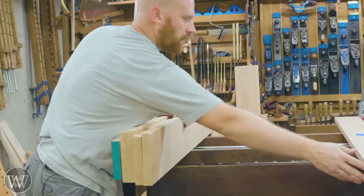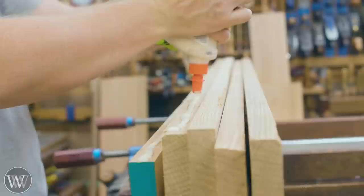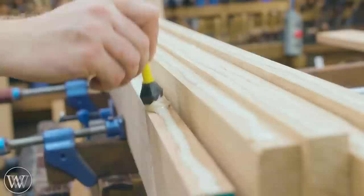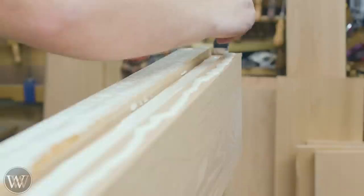I only use the Harbor Freight clamps once every four years or so - they're only there when I need to do a big tabletop glue-up. On to the glue-up: again the Elmer's Wood Glue Max. I'm only applying it to one side of the joint, not both, because it's just a lot easier. Put all of them up except for one, put glue on all of their faces, and set them down. There's going to be a bunch of glue squeeze-out to address, but I'm getting ahead of myself.